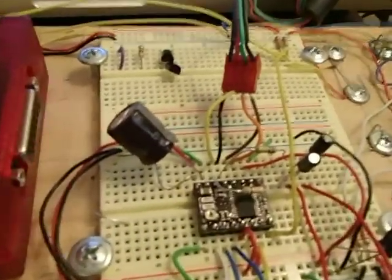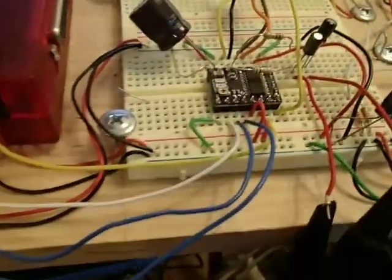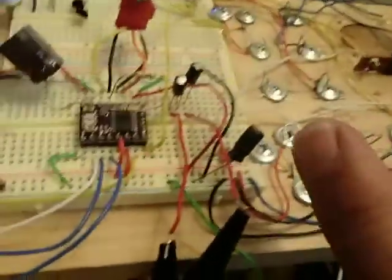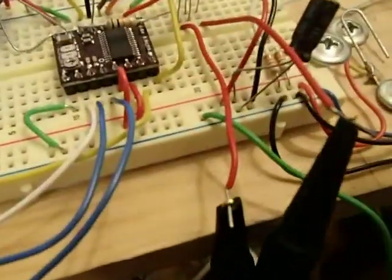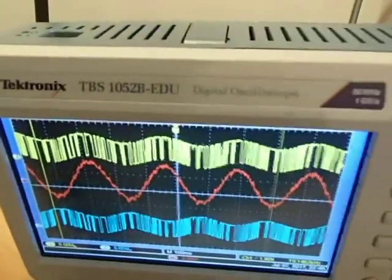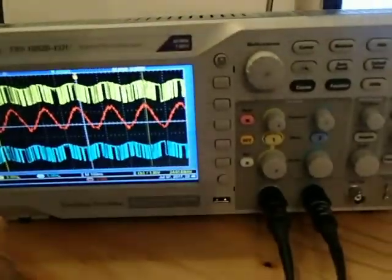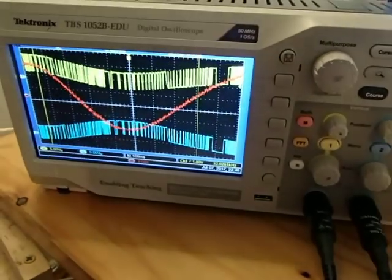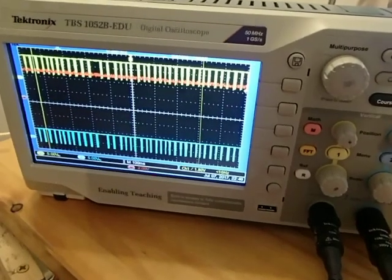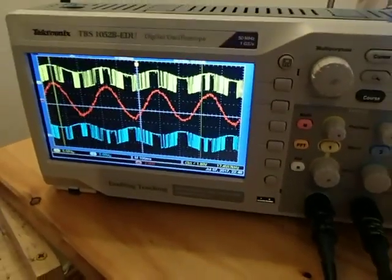The big capacitor here is for filtering — you need a big capacitor right on the power input of the micro-stepper. Also here are the two 10 microfarad capacitors and two 10K resistors making the low-pass filter for the scope. The probes. The scope — also donated by LabJack. Thank you, LabJack. If you want more details, go to halverscience.net — H-A-L-V-E-R-S-C-I-E-N-C-E dot net. Okay, that's it. Bye-bye.